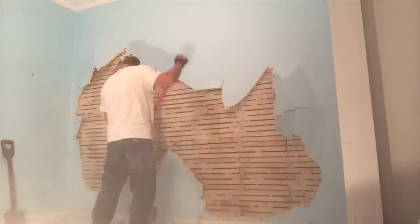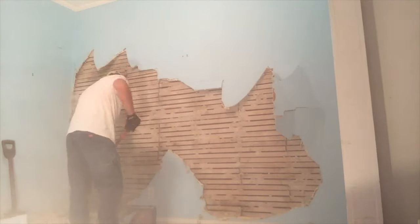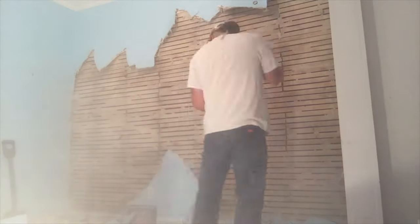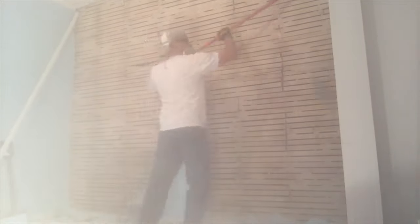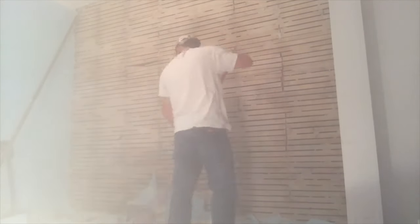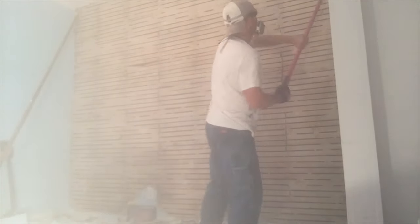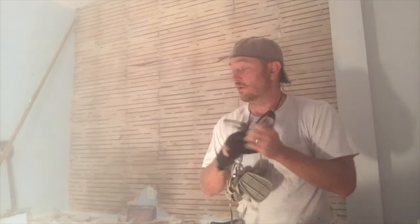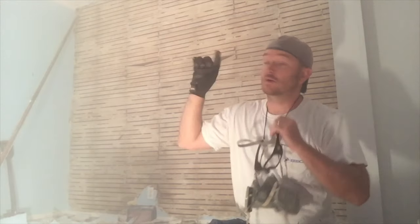One of the things I found helpful was to break up the plaster into the smallest pieces possible — that way it takes up the least amount of room in the bags, so you can use fewer bags to move the same amount and the bags don't rip as much. You can also see the amount of dust created here; it's a real mess, so make sure you wear that PPE. It was less than five minutes to get that whole wall down. My recommendation is always, always leave the lath on until you're ready to take it all down.